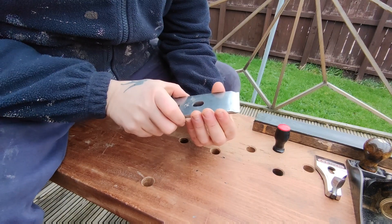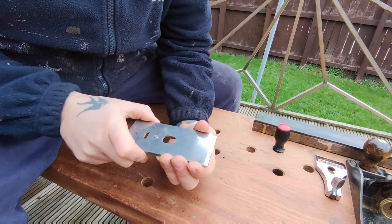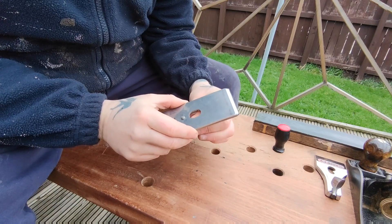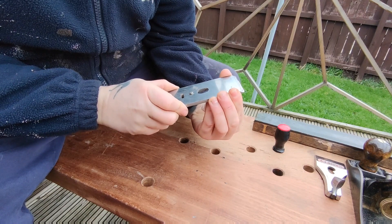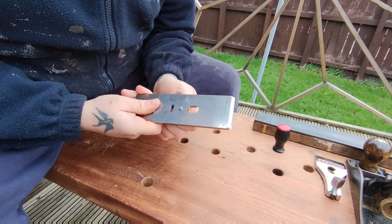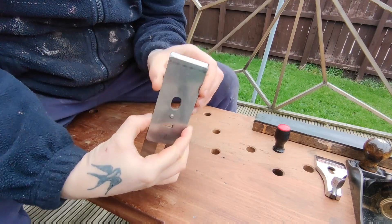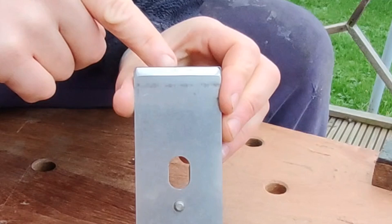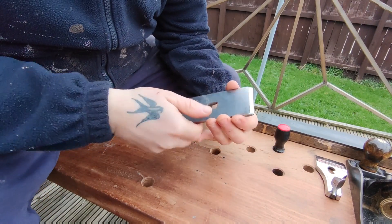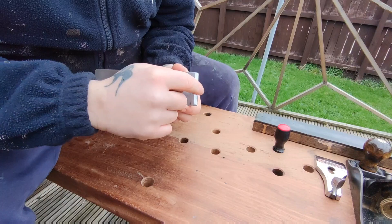I'm going to slide it up. There's a lot of debate about how far you should be from the edge, but I normally go somewhere in the region of maybe one millimeter. I'm just tightening it up finger tight and getting it lined up. I'm going to shove it up a little bit more — there, I'm pretty good there, and that's typically what I'll shoot for. Obviously don't measure this; it's just by eye. Another thing: when doing this I try to make the edge of the chip breaker parallel with the sharp edge.